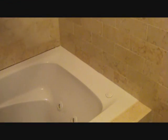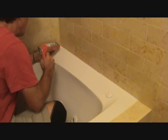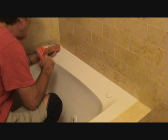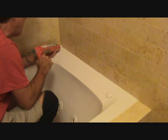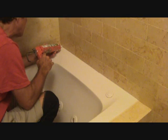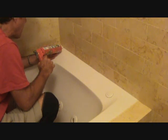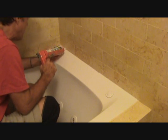Let's give you the full Monty. Get your tip right underneath there — see right there, I'm pushing lots of caulking right underneath it right now. Even without moving it I can see it, because that's a fairly big gap. These tiles are about three-eighths of an inch thick, so you can imagine how much caulking I'm actually pushing under there.